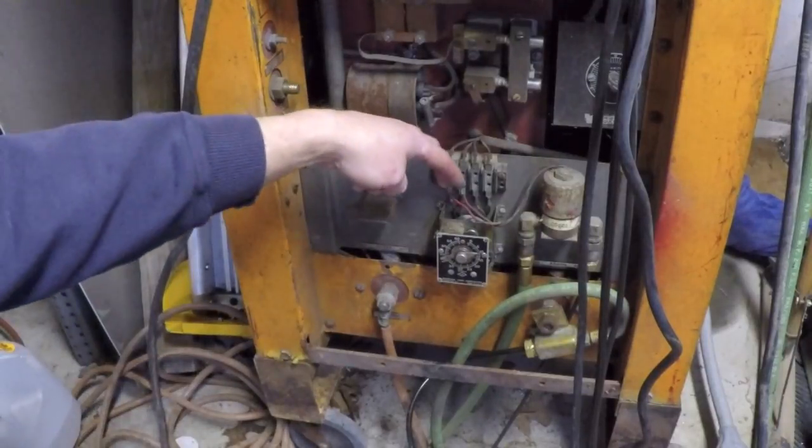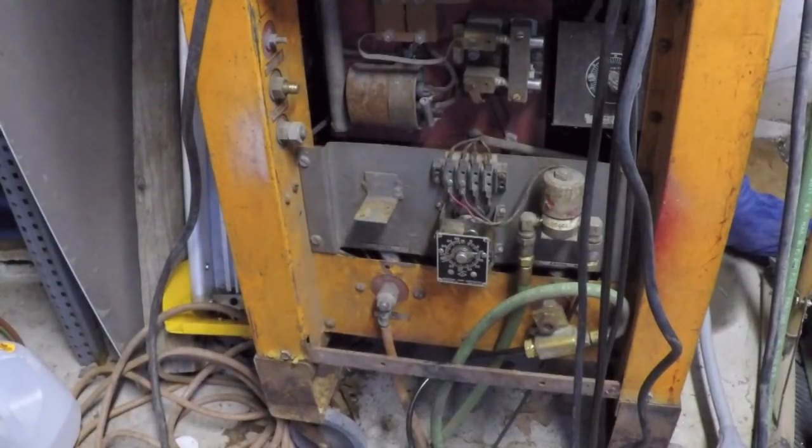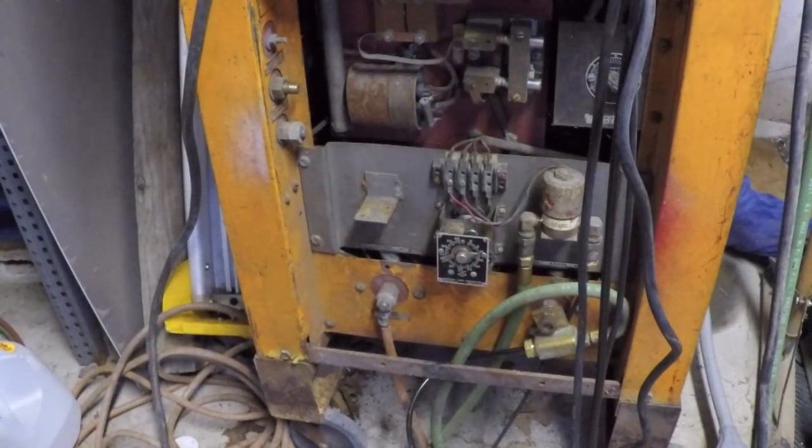And normally they would just have the water solenoid across the same connection. So we should be able to do the same exact thing with the other module. Should be able to directly swap this out, I think. So let's just watch this work one more time before we try this. I'm going to step on the pedal and close the contactor. Oh, I see. It counts down when it's de-energized.